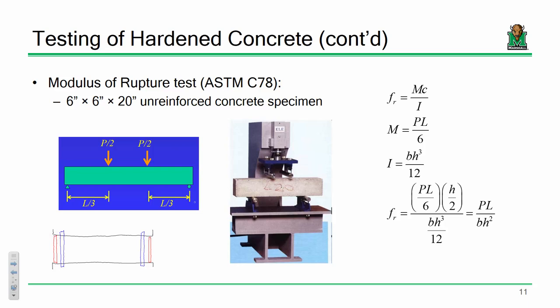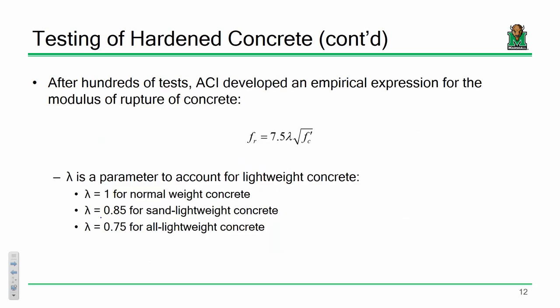And it is a very fundamental quantity in reinforced concrete design because it will tell us, for a given beam, what our cracking moment is. And our cracking moment is an initial quantity that we need to assess to determine the serviceability of reinforced concrete beams. For those of you who already had reinforced concrete design, this should probably start jogging the old memory banks. And for those of you who elect to take it next semester, this will be something that we assess quite early in the semester. So just food for thought for later.